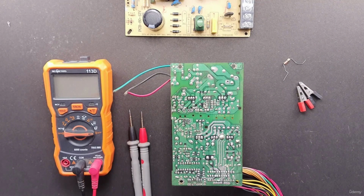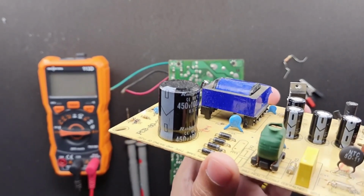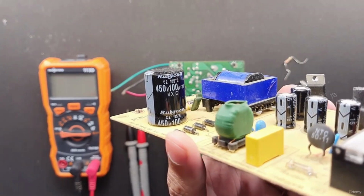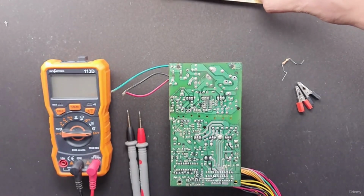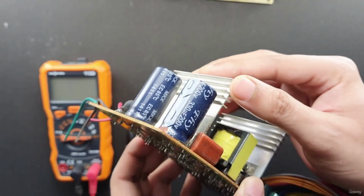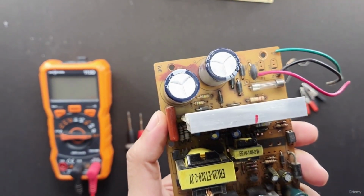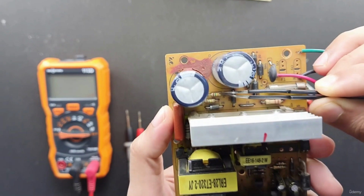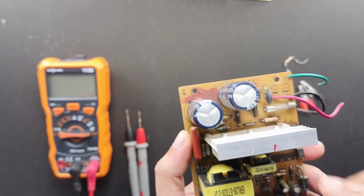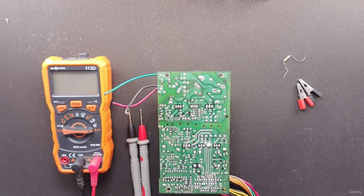Capacitors, especially the large electrolytics, can store a large amount of energy even after the power has been removed. Some can be fully charged even after many days. Usually, circuits will have discharge resistors for these capacitors, which will discharge them in a matter of minutes. But the only way to be sure the capacitor is discharged is to discharge it yourself.